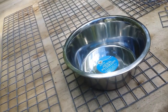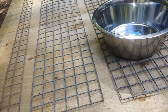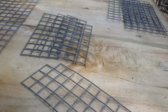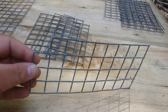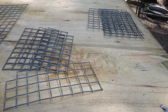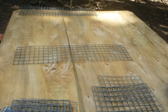I'm going to build this so that it will hold three bowls. This piece of wire is going to be the bottom of the feeder — it is 27 inches long, and we're actually going to use three pieces that are 27 inches long. The front piece is six inches by 27 inches, and we're going to do something special to that. We also have an additional piece that is just two inches wide and 27 inches long. In addition, we're going to need four pieces that are four inches by nine inches — those are going to be the two ends and the two dividers between the three bowls, and I've notched out one end. And lastly, we're going to need three doors — pieces that are six inches by ten or eleven inches.